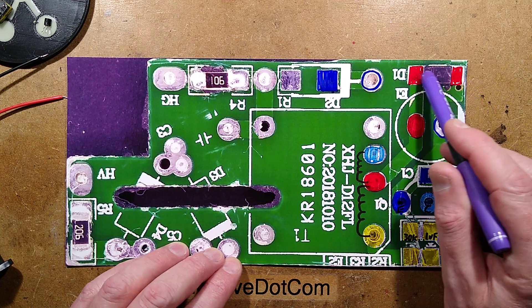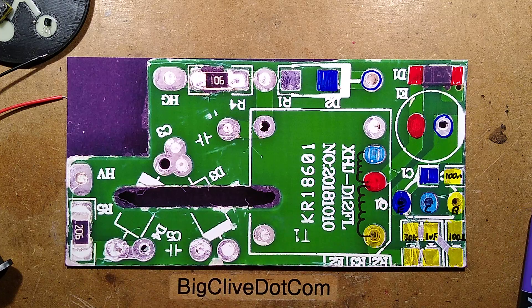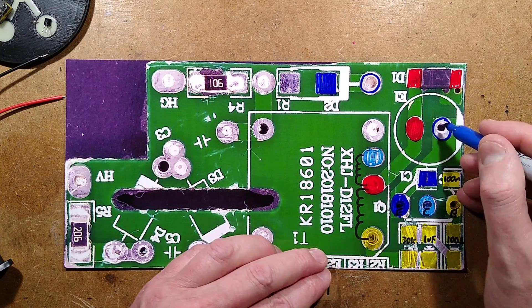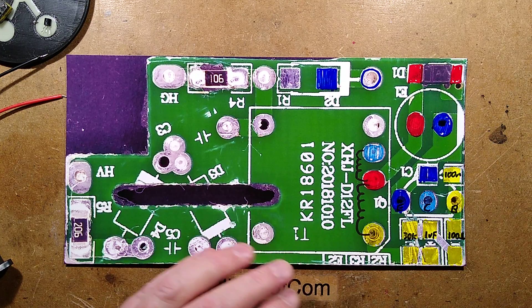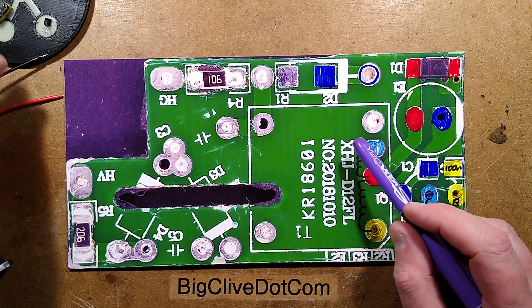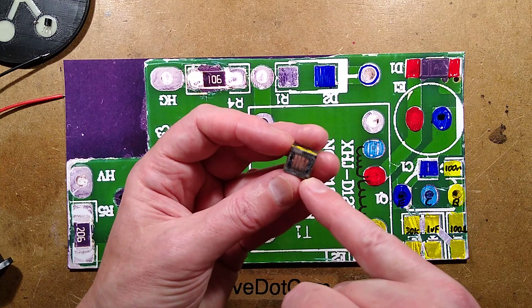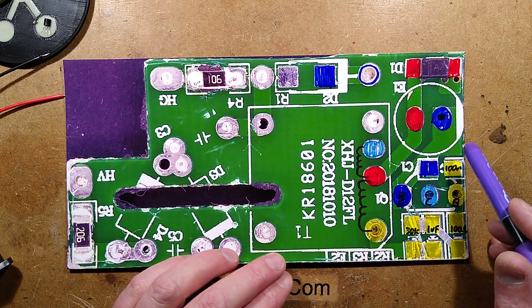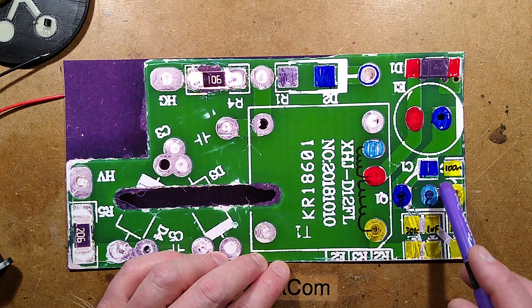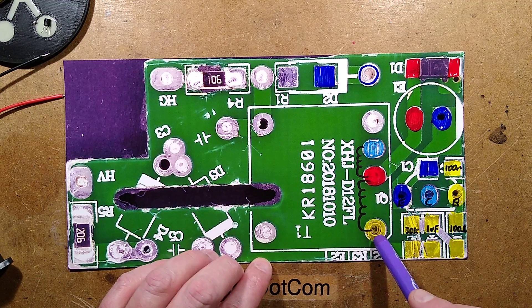The incoming positive supply goes through a diode and it goes to a smoothing capacitor — a general local capacitor. I shall finish this drawing by colouring it in with one of my crayons. That's a 220 microfarad capacitor. It goes to this little transformer — a very neat little transformer. It's as though it's got an actual primary section and three secondary sections. Then there's a transistor, and associated with that there are four surface mount components with the feedback winding.